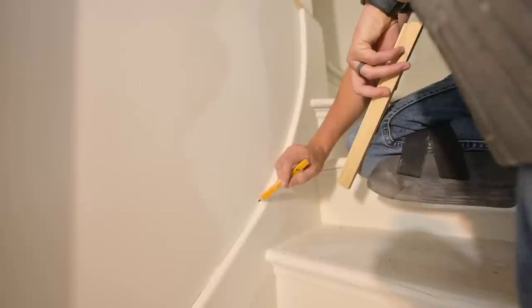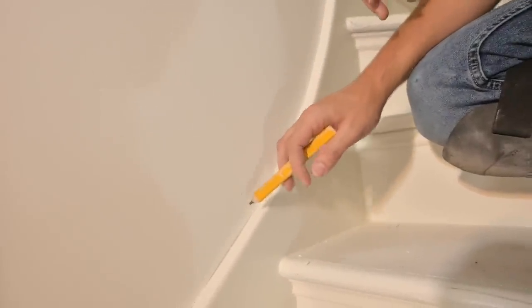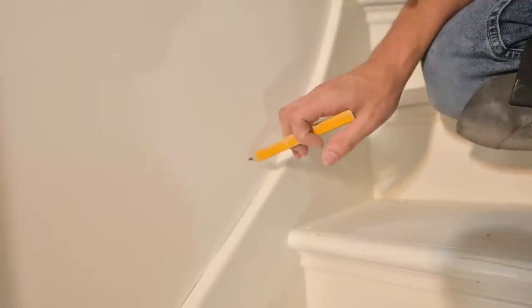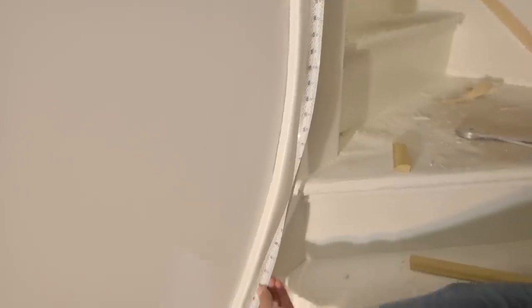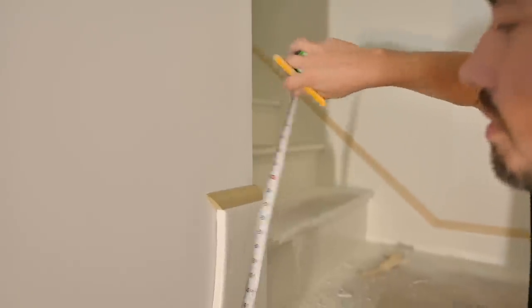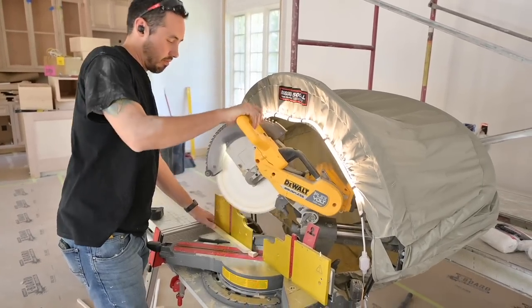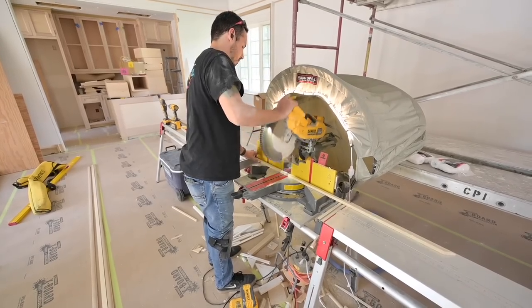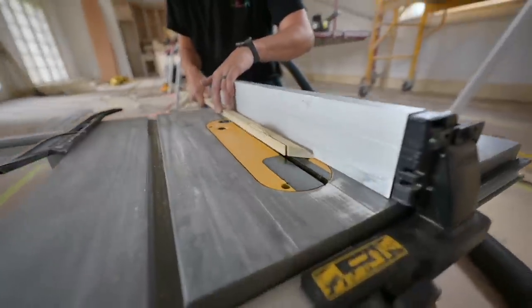As long as I'm past this point with my bent lamination, the other side doesn't really matter because I'm going to leave these pieces long, then come back with a square and a multi-tool and zip that straight. We'll have a seam right there and dial that in — it'll sand in and look good to go. I'm going to put a 45-degree cut on my long pieces, then start ripping them into strips. We'll say about 33 inches — that gives us plenty of room with leftover to cut off.